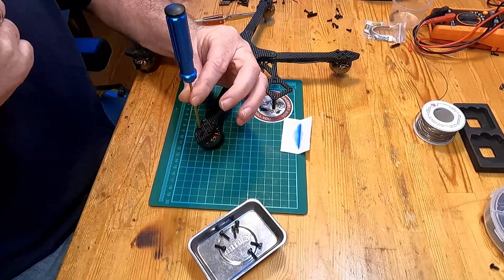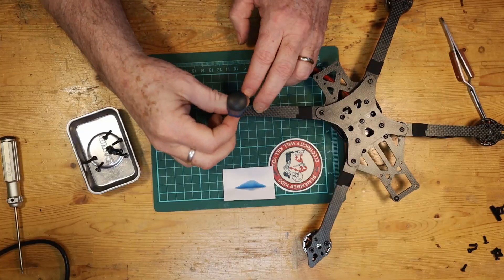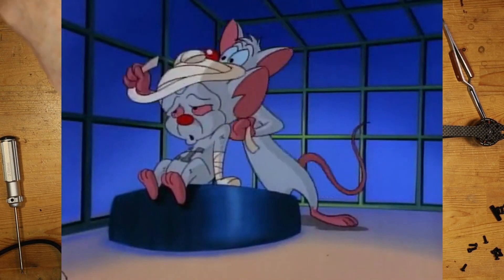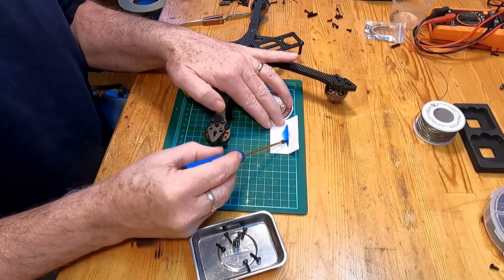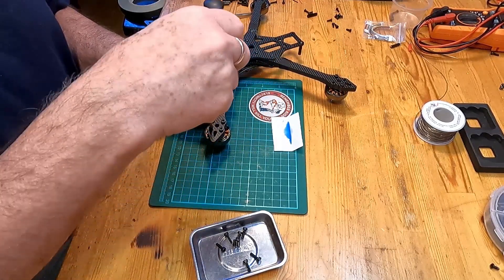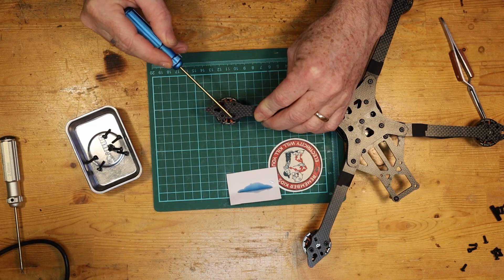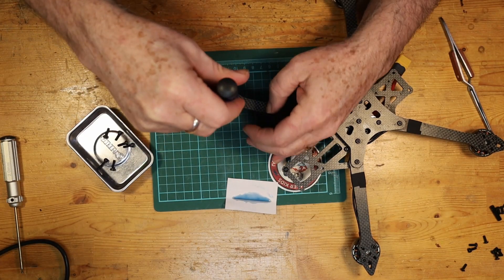To avoid cross-threading, when you first put a bolt in, spin it backwards and you'll start to hear tapping as it drops into place properly — that tells you it's now lined up and you can start spinning it the other way without stripping the threads. Basically finger tight — careful, not too tight. These are steel screws and the base of the motor is aluminum, so you can completely strip it out if you go too hard. I've put the two new ones in with thread locker, so now I'll take out the ones I initially put in, add thread locker on them, and replace them. We'll continue doing this until all the motors are done.